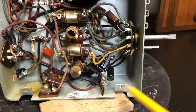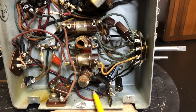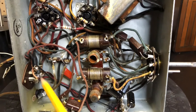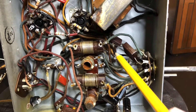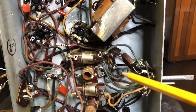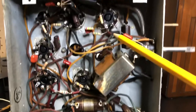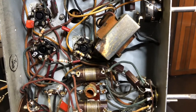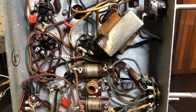Replaced this electrolytic. Put in a new wire over to here. Double checked everything. Resoldered the line from the center tap to all the negatives. Checked all the continuity to the wires. Connected to that wire. Everything looks right. Let's see what happens when I hook it back up.